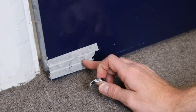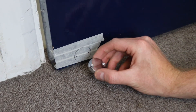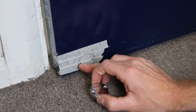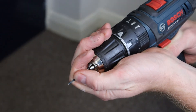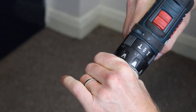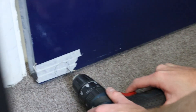I've marked the location of the corresponding magnetic part using the circumference of the part, and also marked the two drill points where I'll make pilot holes to fix it with two wood screws. To fix the corresponding part onto the door I downsized the drill bit to a two millimetre bit, because the screws for the corresponding part are smaller than those for the main part on the skirting board. I'll simply drill the two pre-marked locations.